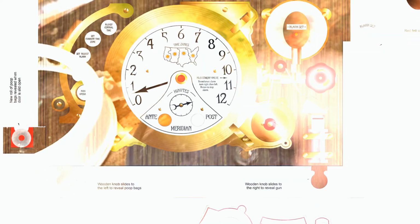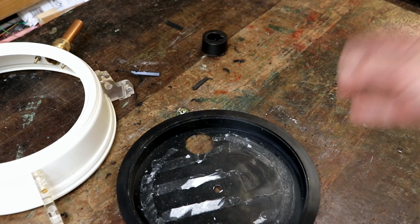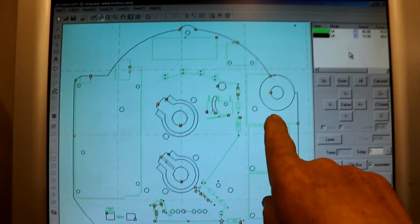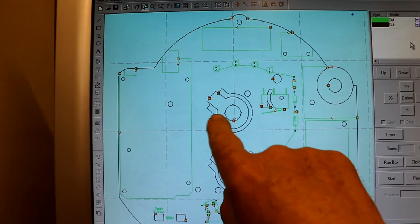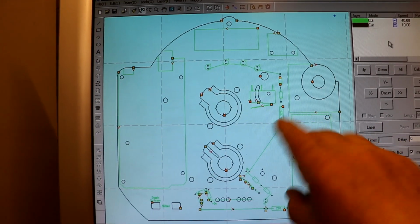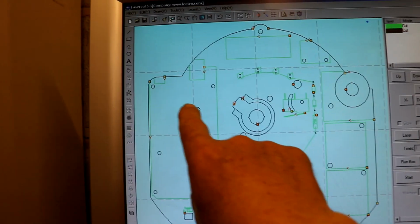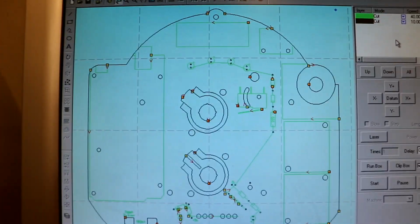Now I'm going to go and cut out the 3mm piece that I've got designed on the computer, that's going to mount the majority of exciting parts on. Here we have it. So this is 3mm acrylic. It's going to support the 2 stepper motors, and I'm also not wasting plastic. I'm cutting out the sensor holders for the stepper motors. So the switch, it's all worked. I've had to design it back to front, looking at it from the front. I've flipped it over now. That's where the Arduino Mega is going to go, etc, etc. The green lines, zoom in.